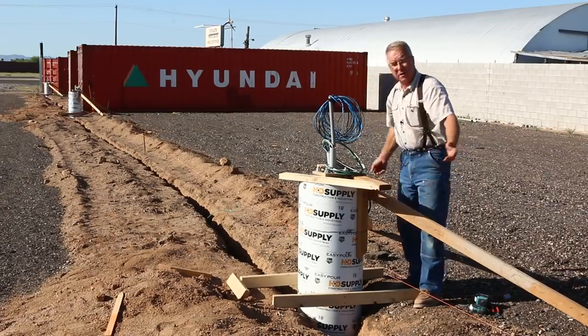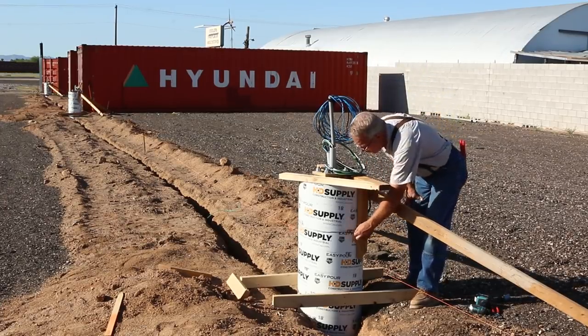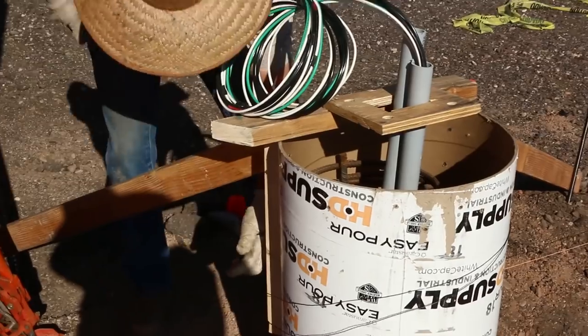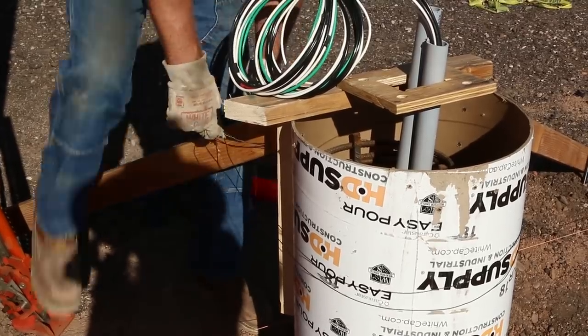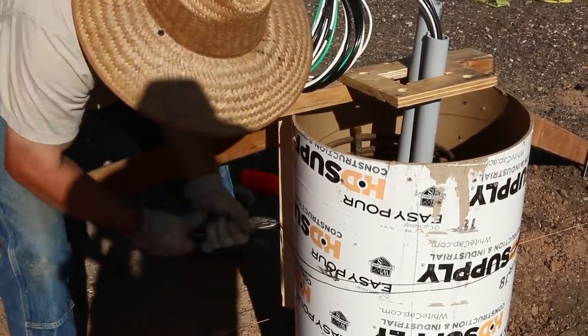You try to do this with a nail, you knock the world apart, it's no good. But on the other hand, you're just screwing into cardboard. So I run a piece of tie wire around there to hold that, I'll call it a ledger, it's not exactly a ledger, but to hold that piece against the cardboard with something other than the two screws.